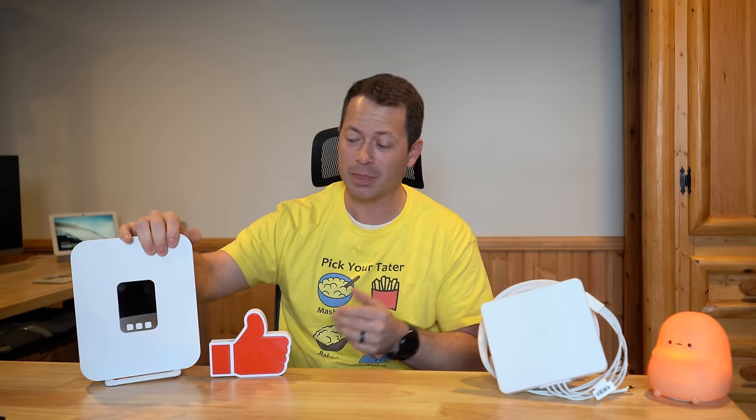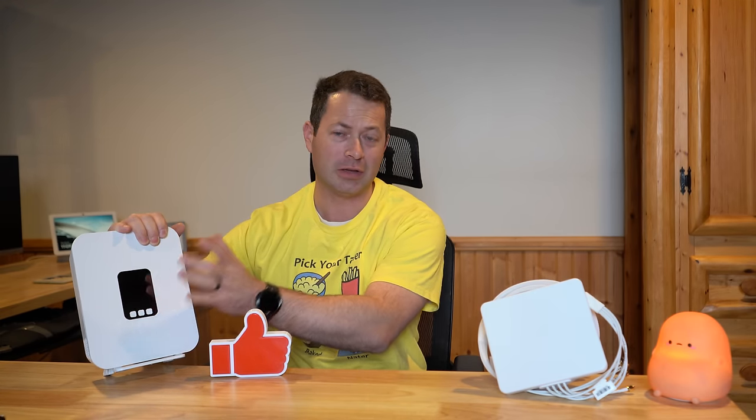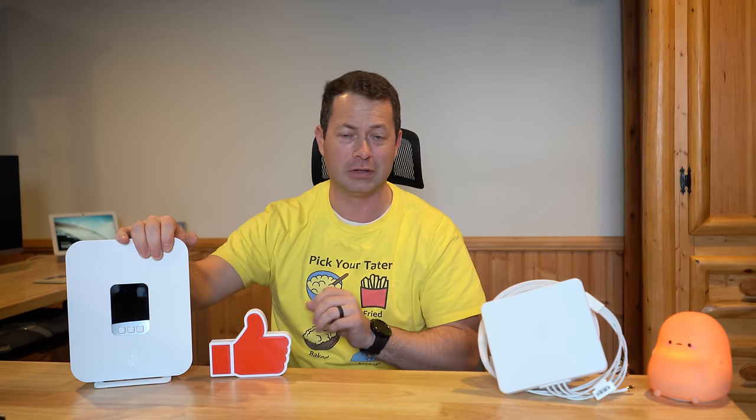But there are a couple things that people have been finding out about these antennas, and I want to share some of those with you. One of them is actually courtesy of Waveform, posting on their Signal Squad Facebook page. And that is folks that are having trouble getting the external antenna connection to actually hold. In the settings on the front, you just click over a couple times, and then there's an option for you to select internal antenna or external antenna.